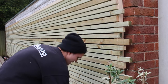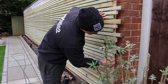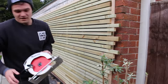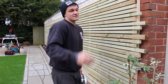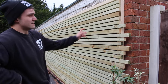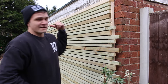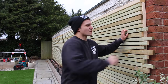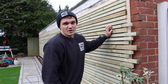You might notice the battens are still left long. I did that because I didn't want to trim into the timber where it's quite visible coming up the stairs. I set the depth of the blade about half a mil off the full thickness of the batten, scribed a line with a spirit level, and cut them off. It's a lot quicker — one of our cuts was like a 2.4 to 2.37, so instead of cutting it twice we just tracked it long and trimmed it off at the end.